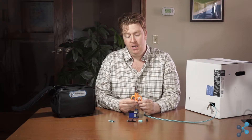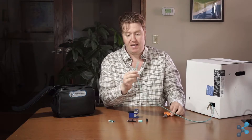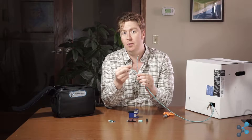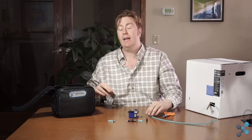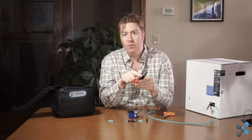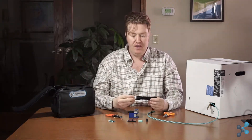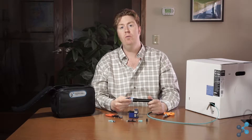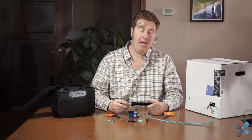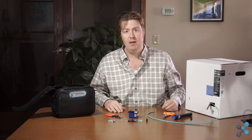Then we have the shears, which are made for cutting fiber. These are special shears because, as we'll see during construction, there's Kevlar aramid yarn inside the cable that gives it its strength, and the shears are made to cut through that. We also have a wire snip for removing the outer jacket of the fiber. Finally, there's our VFL — a handy test tool we'll use when testing the fiber and verifying a good connection. These are the four main components of the termination kit.